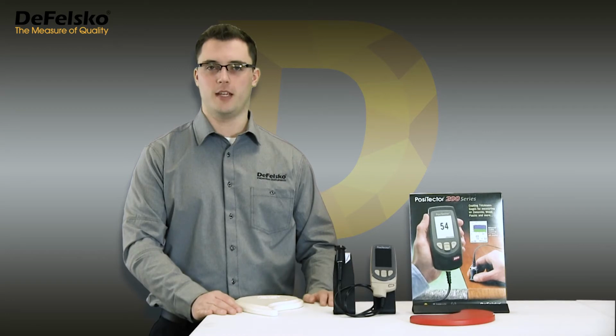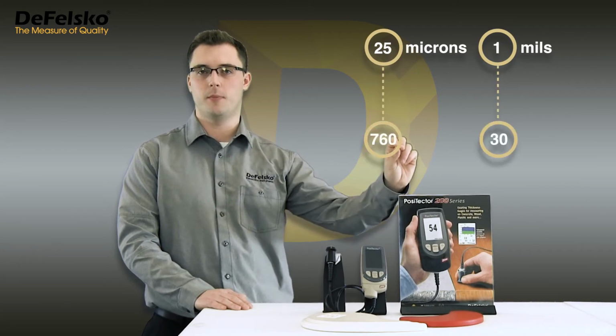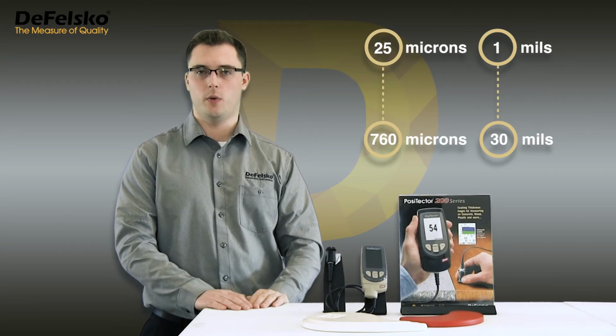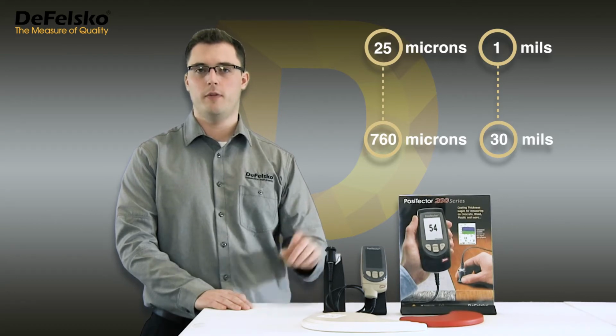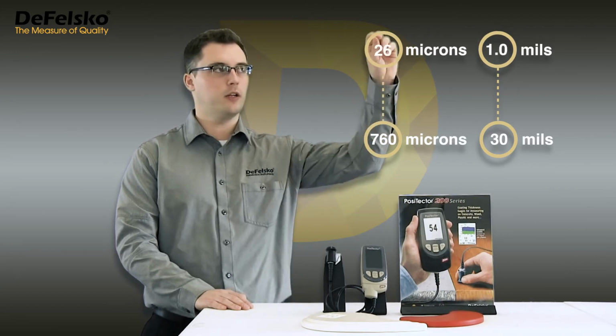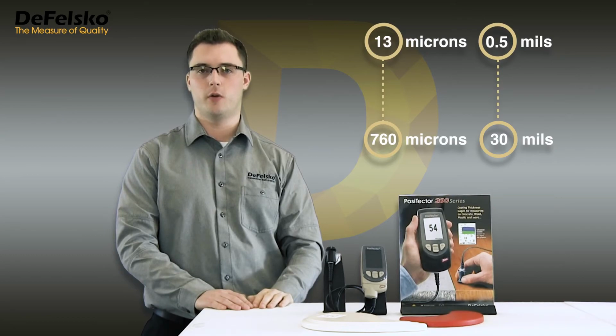The best way to prevent these occasional low values is with a simple change to the instrument's low-range setting. PosiTector 200B models have a default measurement range of 25 to 760 microns. The low-range value is the minimum thickness the PosiTector 200 will report. The high-range value is the maximum thickness the PosiTector 200 will report. The default high-range value rarely needs to be changed, but a properly adjusted low-range value is the key to successfully measuring rough coatings.